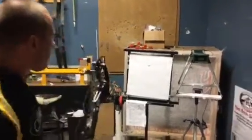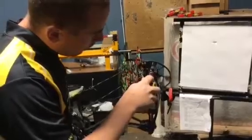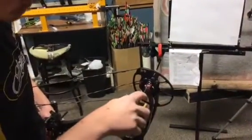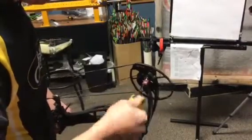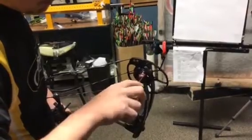You can see we got a kind of a severe left tear, so what we're going to do is we're actually going to shim the cam over to the left just a little bit. There's a lock on the cam — crack that loose and you're actually going to push the cam over to the left. We're going to do top and bottom and see if it makes it better.